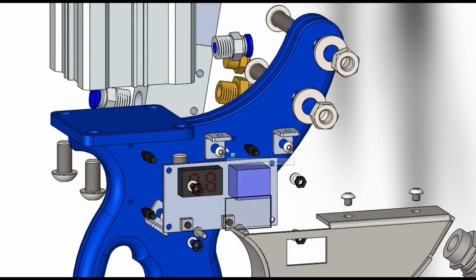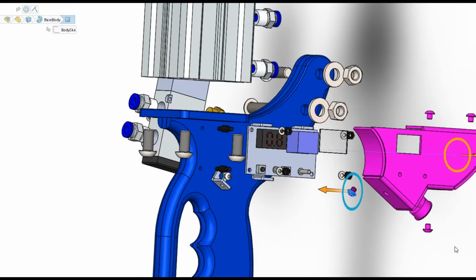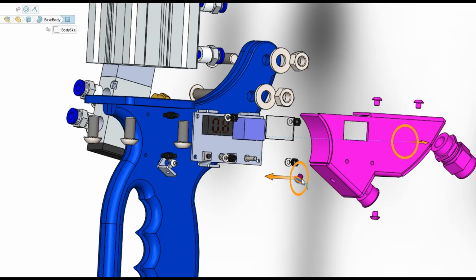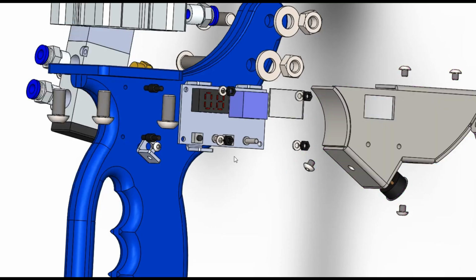So these brackets here are for the mounting of this wee small enclosure. There's 4 of them, and these bolts here, sorry, I'm a wee bit out of view here, these bolts here screw into the tapped hole. This bracket screws into the tapped hole of the plate using 4 mil. I think it's, no, sorry, these are 5 mil and these ones are 4 mil. So these are 4 mil dome head screws, going through this hole into this bracket to bring it all together.